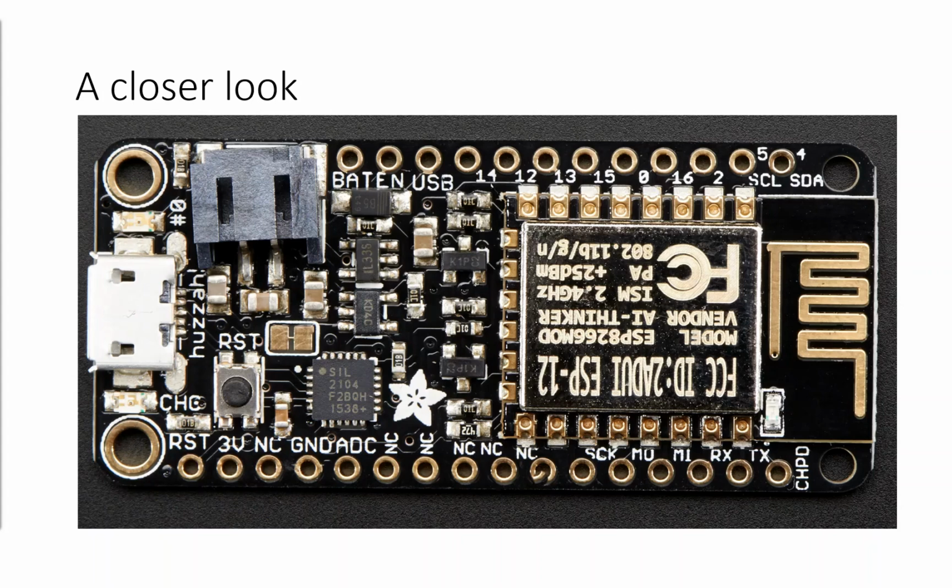And there's been a good amount of traction as well about going from micro USB all the way down to USB-C now, so we've got a nice common connector between all of those boards. One of the important points to note is that these boards operate on 3.3 volt logic, whereas most Arduinos, like the Uno here, operate on 5 volt logic. When you're buying components, you just have to bear in mind you don't want to try and feed 5 volts into one of these, just in case you accidentally blow it up.